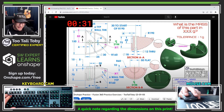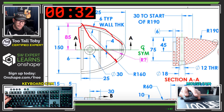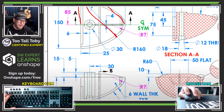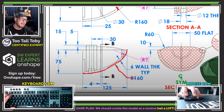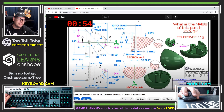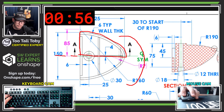The other thing I noticed on this model is that this 160 here in the top view is great — it's defined properly and gives us a nice profile that we can revolve to 180 degrees. But when we look at the front view, we see that that 160 is not really as clearly defined. It could be confusing if you were thinking that should maybe be a loft or a sweep, but no, the solution for this one is going to be a revolve. You're going to want to create the first sketch here on the top plane using these driving dimensions, and then once you have that sketch, you'll do a revolve at 180, which gives you the bulk of the egg.